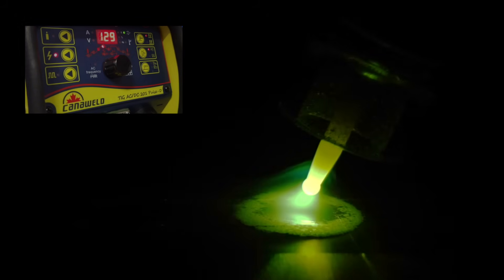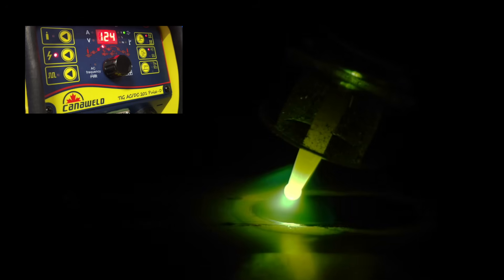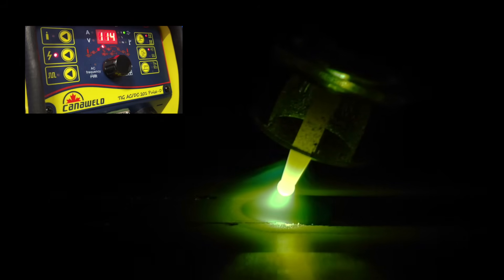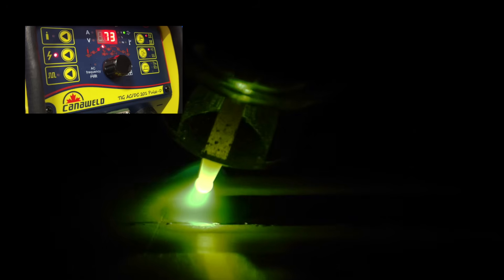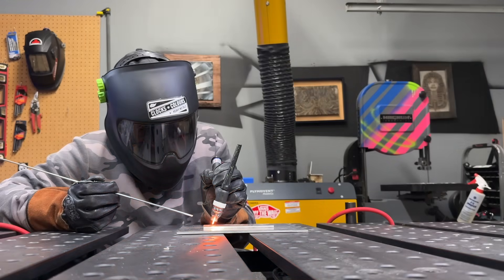While that's not a bad ballpark to start with, let's not take it too seriously. Watch — this weld I'm doing here is just a dry pass with no filler material, or what I call dry arcs in my online courses. You can see I start near that amperage then back off as the material heats up and needs much less. I usually add an extra 10 to 15 amps from what I think I'll need, then just mitigate with the foot pedal. Set it and forget it.